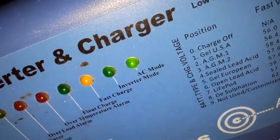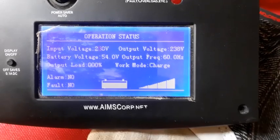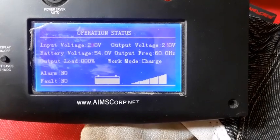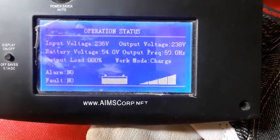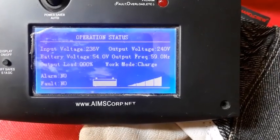Sorry about the grainy video. So this is inverter mode and this yellow light is fast charge. We're going to go start the inverter — that green light should switch to the yellow fast charge mode. And there we go — we are inverting. Got the generator on. My battery is at 54 volts, which is 70% full. Work mode — you can see it's in charge. And we're charging. I'll get this up to 56.4 and it'll go from work charge mode to float mode, then we'll let the solar take over the rest. We finally got our light show — the battery is full, it's in balance mode.